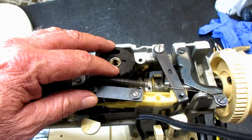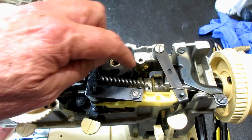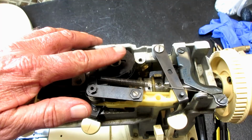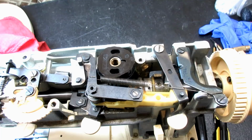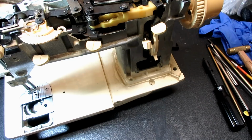If you have the 354, there's supposed to be another pattern, so I'm assuming there's going to be another cam. And either it replaces that base one with the screws, or maybe the cam stack is a little bit taller and they put one more cam on the top. You'll notice it when you take it apart, right? And you're going to take pictures or make a sketch or whatever as you go, so you'll know which way they go back on.